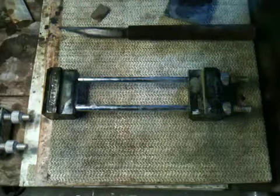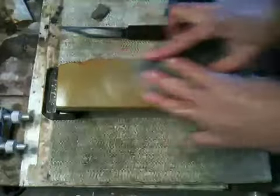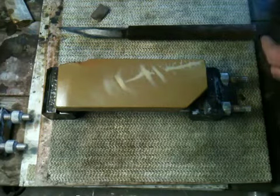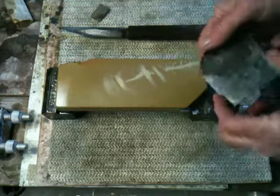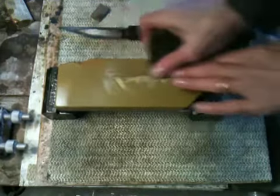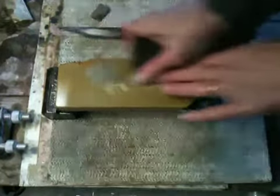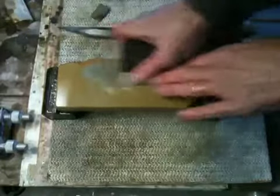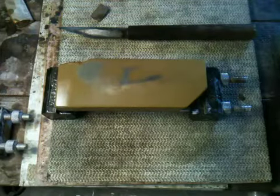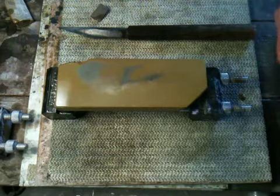I'll repeat that same sequence with just the kana blade, and you'll get a better picture of what's happening. Rinse the blade off. So this is probably Hitachi steel. It could be Swedish steel, but this is a 1940s, 50s blade. Tremendous cutting action going on here, and it's very, very smooth. This kiita is a grit-rich stone. There's a lot of silica that's available, and the stone itself is not overly hard. So that's one video.